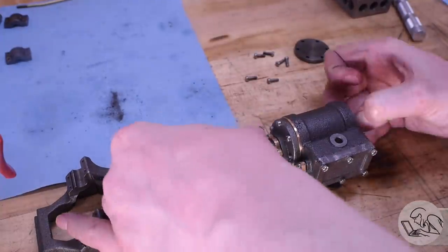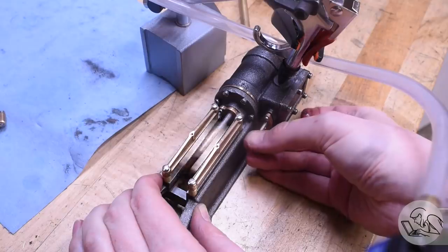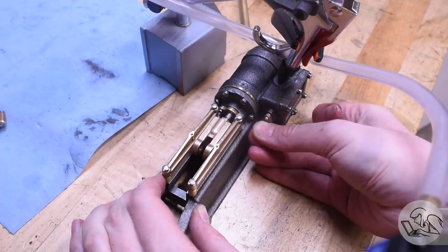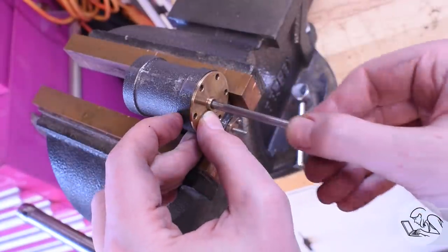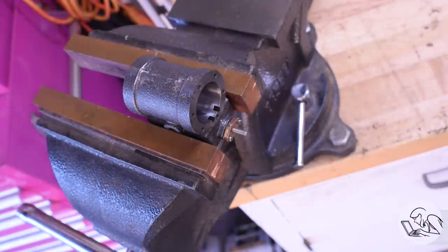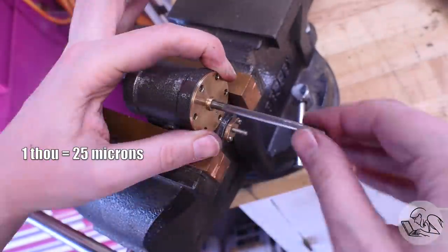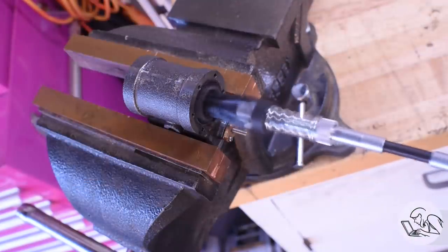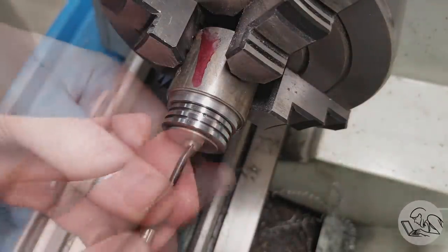I can check the crosshead against the slide, then the crosshead with the piston rod, then the crosshead with the rails, then the rails and crosshead and piston rod together, then the piston and rod together, then all of those pieces all together. Doing it methodically like that you can narrow down where the sticking is coming from. In my case what it really boiled down to was that the piston just needed to be a little smaller - I think it was just one thou too large and at the far end it was just getting a little bit stuck. I also honed the piston a little bit extra at that end, which did help, but I decided to just take a thou off the piston.